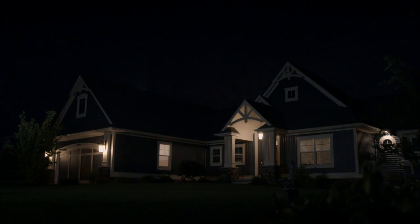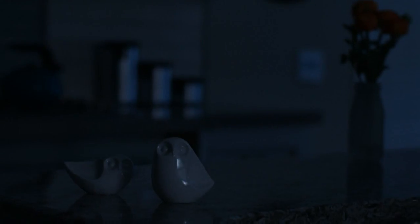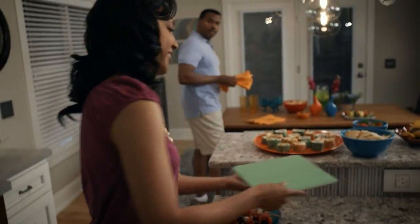The first step in setting up your whole house lighting system is acquiring a unique house ID. This means all of your switches, dimmers, and remote controls will be bound to just your system and will only communicate with each other, versus with a nearby system. This process is called house binding.